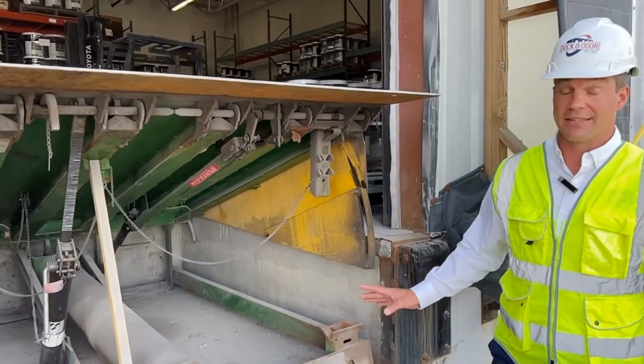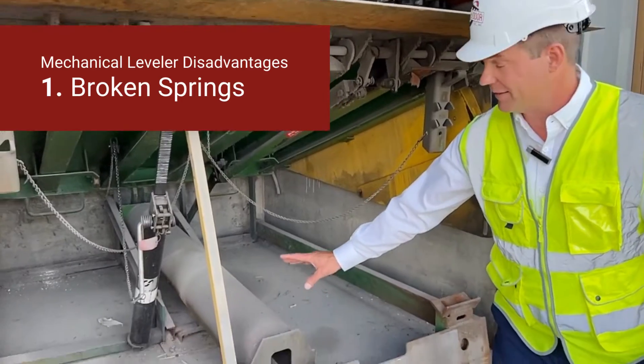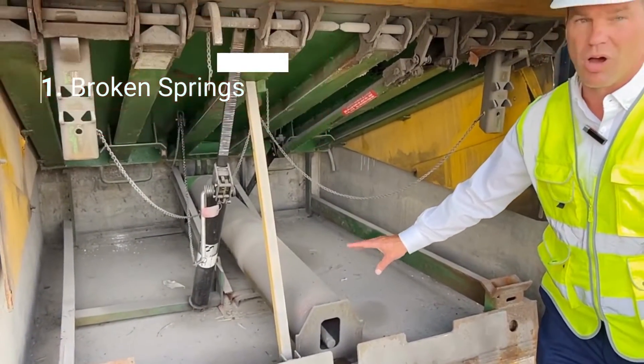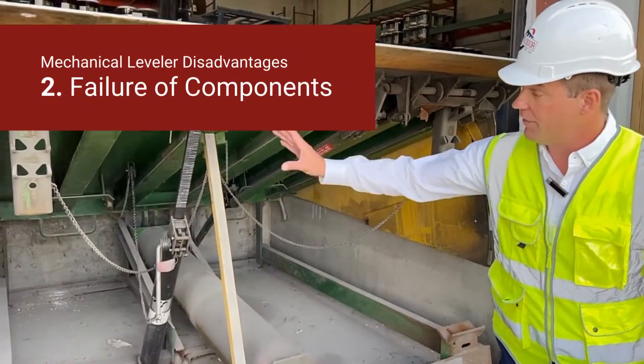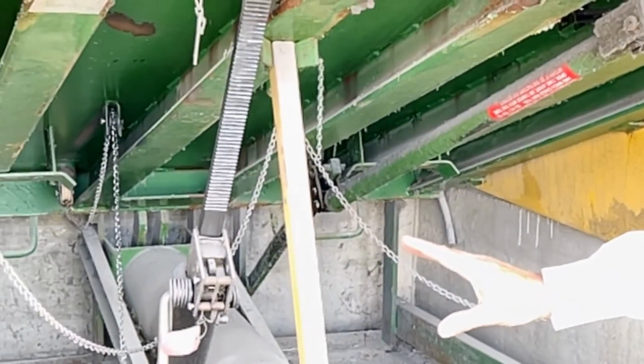With a mechanical leveler, there's a lot of things that can go wrong and do go wrong. One of the first is a spring — this particular model has a very large spring and a pull rod. There's a bearing at the back. Things can break and render your dock out of service for a while until you can get parts, if they're even available. You also have a hold down, which acts as a brake in the dock — lots and lots of moving parts and pieces there.